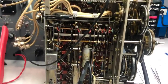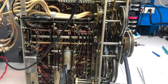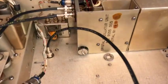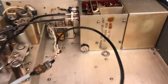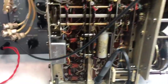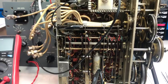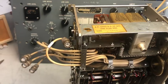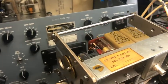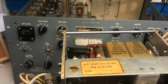It's time to check the alignment mechanically and electronically — it's very easy to make some turn and lose the synchronization, as well as the crystal oscillator and the PTO down there. Let's do that and try the receiver again.